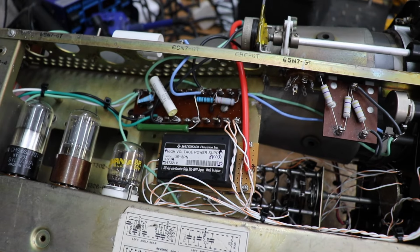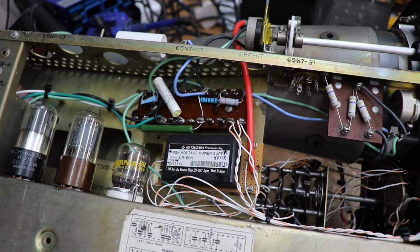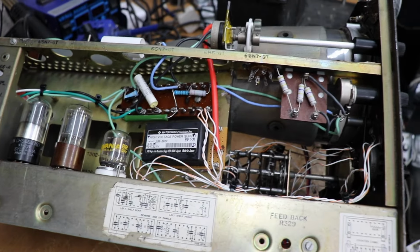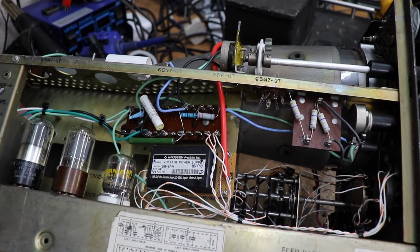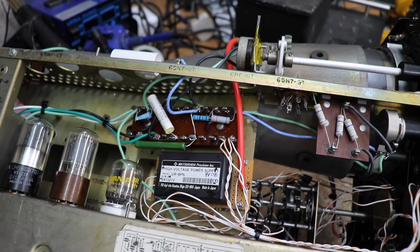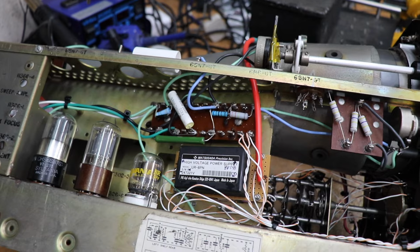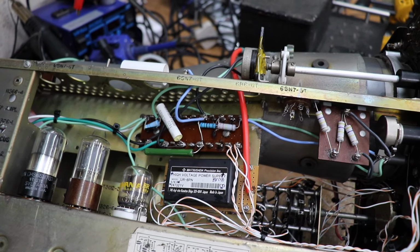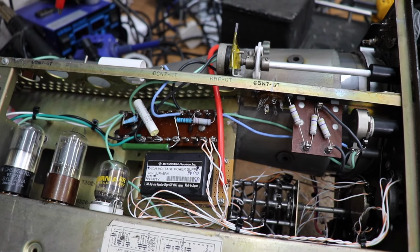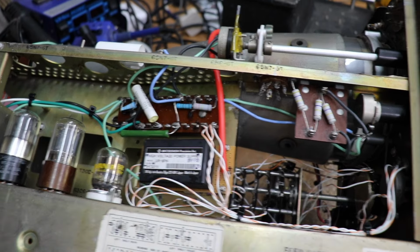Now I tried to use a 6SN7 and a half a 6SN7 because I'm not short of holes for valve holders. But I would say that it worked, but not as good as actually using the original Compactron triple triode. And I think that may be because using a 6SN7 plus a half a 6SN7 probably caused a little bit of extra capacitive effects, which affected the time base. That's a cute little valve actually, and it glows quite nicely. Three triodes in one glass envelope.